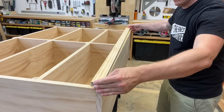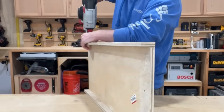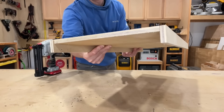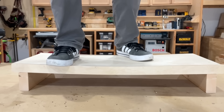And those skinny supports don't necessarily have to be beneath the shelf — they can be attached to the edge as well. Face frames are often used to dress up the edge of a shelf, but they're not just for decoration; they also make the shelf stronger. By gluing and shooting narrow face frames to the edge, the shelf gains applied support from the side. This means the shelf can now bridge an even longer span without deflecting. It's not quite as strong as when the pieces were beneath it, but it's still considerably stronger.